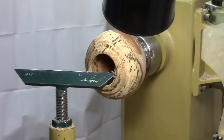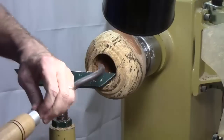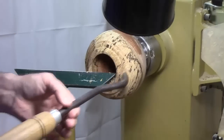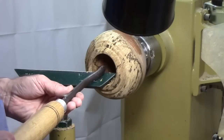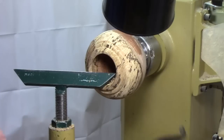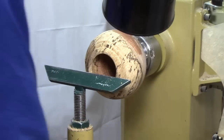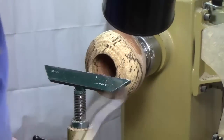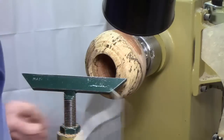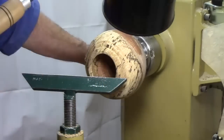I think I'm going to switch to some hollowing tools. I'm going to start with this John Jordan — I think it's a half inch — and I've got a little magnet here to help show me the orientation. This is a little less aggressive if I tilt it this way. We're just going to thin the wall a little bit, but I've got to move the tool rest back. I have to support the tool behind this hook otherwise it's going to spin on me. This is where dialing this in really helps — it looks like it's right about on center. So I'm going to start here, start thinning it, and haul it out.